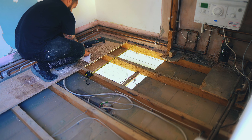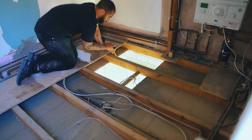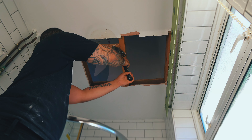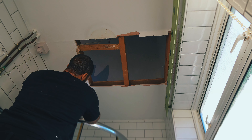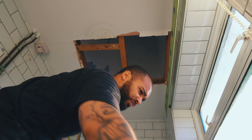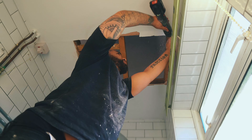A side note: the wiring in this house is all mad. I don't understand it — the red cables are all linked but nothing's got red as live for the lighting. In my training, the old color system means red is supposed to be live, but in this house only the sockets have red as live, not the lighting. I've been gradually, as I get through each circuit, trying to wire it properly and label it — wrapping brown tape around the cable being used as live so future workers can identify which cables are which.